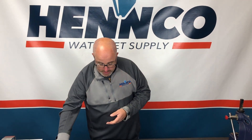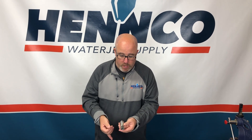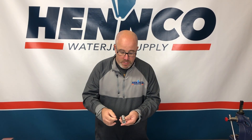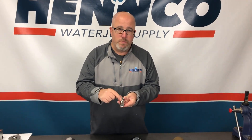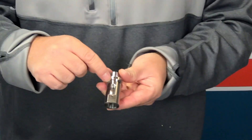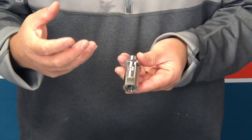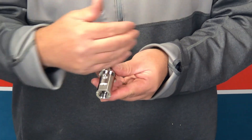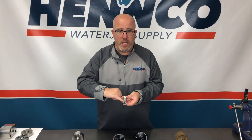So if you look at any of these valve bodies, we're going to have different weep holes. Here's a Flow Insta-1 — we've got the top weep hole. In this design, it is more of a collar design where the high pressure line and the cone are making the connection at the actual valve body. So instead of being a weep hole, you're going to see leaking coming in or around your high pressure collar. And then again, we've got the weep hole here.